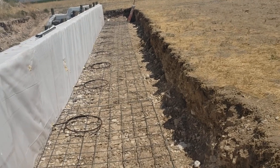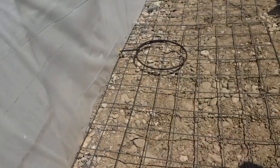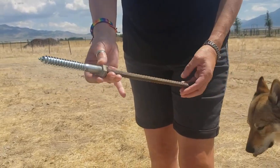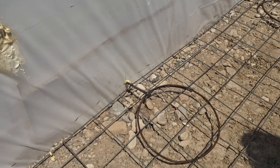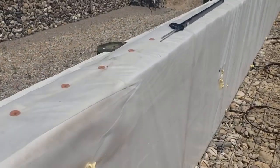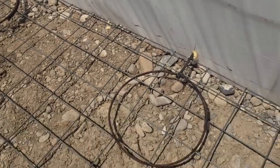Here's a quick look at the anchor bolt that I actually put in at this location. You can see right here the location I put these in — this is the anchor bolt here. It's a 5/8 lag bolt with about a 1-foot, 12-inch piece of half-inch rebar, and then I just welded a 5/8 nut on it. I needed to go into the wall probably all six inches there through insulation — four-inch insulation — and then I wanted that bolt in another good inch. That sunk right into the wood post; the gabion wall with rock is every 5 feet on center, and that's where I put the anchor bolts and then welded these hoops.